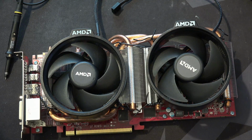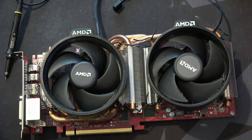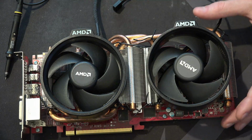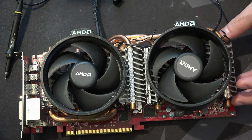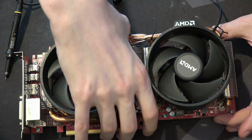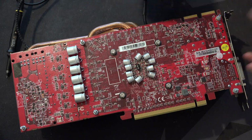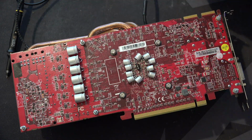So that really sucked. That's kind of the main issue you can run into. Other than that, the main concerns with cap mods are don't make a short circuit, but that's a concern with any type of modding, right? Don't short something. And then the structural integrity is also an issue. If you're attaching to multi-layer ceramics, then you do make it very easy to rip them off by extending these massive levers to them.